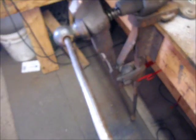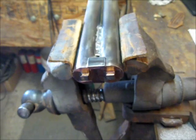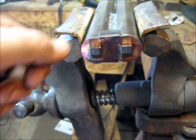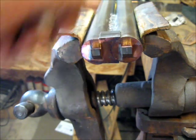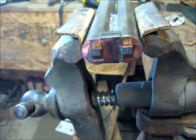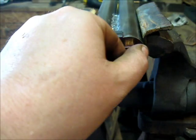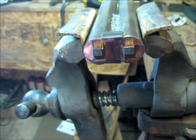I'll move around back here so you can see it better from the end — you can see how it looks when it's all tied together. The top rib will be tied in, the sides lined up perfectly with the top rib, and the bottom flat will be shaped to match the contour of the bottom rib for the ramrod. You can see how the two separate breeches work: if you ever have to un-breech this, you take one out, back it out, and that allows the other one to unscrew. That's pretty much how a hooked breech is done on a double rifle.